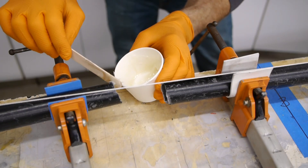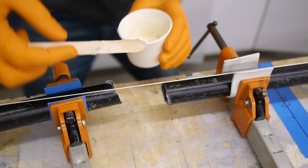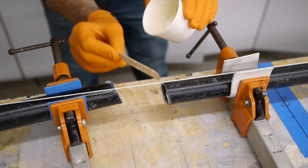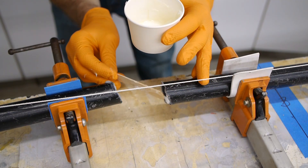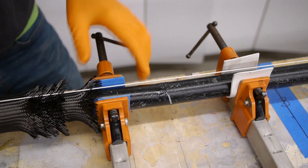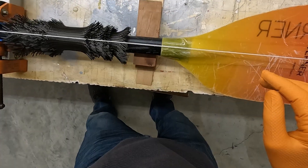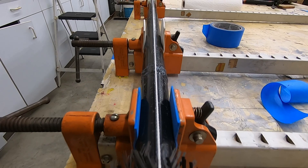I'm not trying to hide this screw up — I just wanted to show this process in the right order, and I didn't think this video needed any gratuitous swearing. I mix up some epoxy thickened with fumed silica and a little milled fiberglass for strength, then apply it to each side of the break. Gluing things together with plain epoxy is just weak and sad, so don't do it.